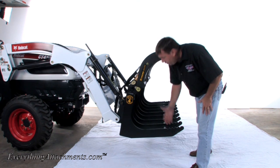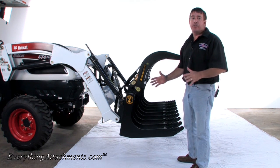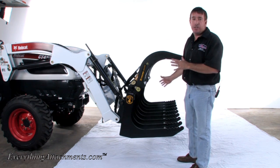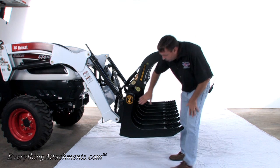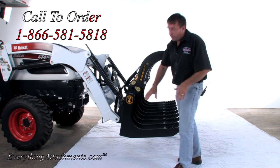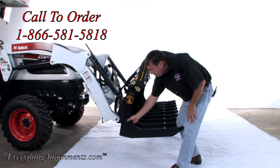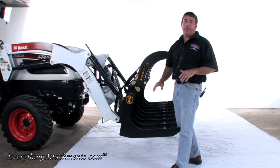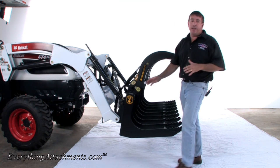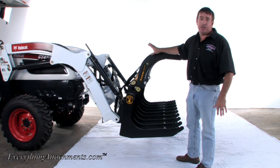Because it's a little bit longer, if I'm going to be in tight quarters I cut the width down about six inches from my normal bucket so I can get around better. If I've got a big field and a lot to do, I probably want as much width as I can get. Construction Attachments uses a one-piece tine, which is a lot more expensive than using two pieces and welding them to a square bar. It uses a lot more steel out of a plate to burn that tine, but it makes it about twice as strong — and by making it twice as strong, we can make it a lot lighter, leaving you more capacity left in your compact tractor.